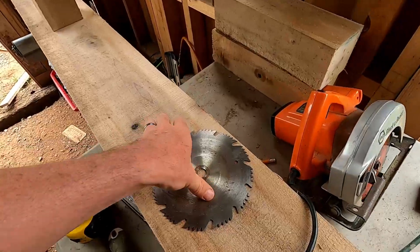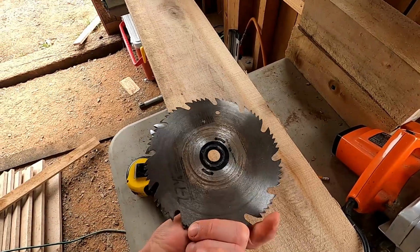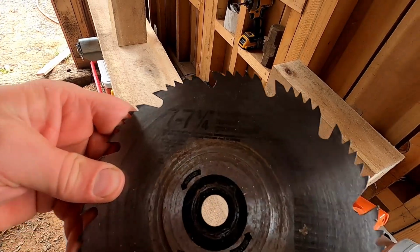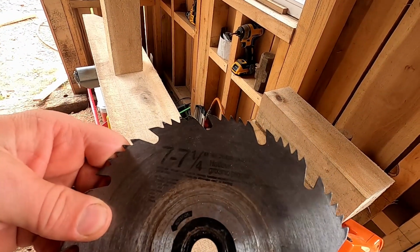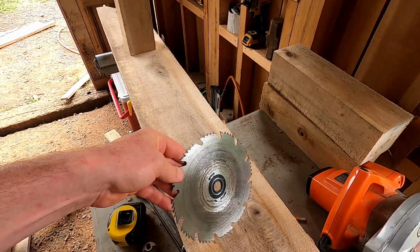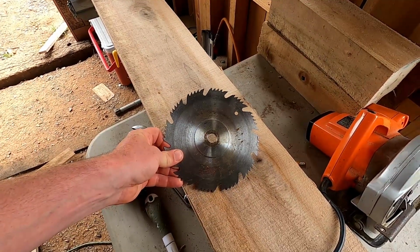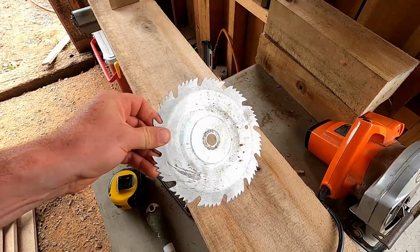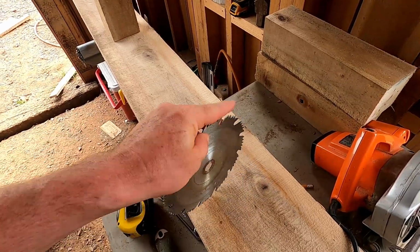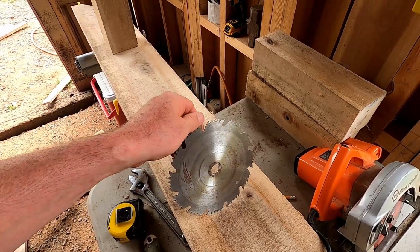Also, I wanted to mention, this is the blade, this old blade. I think it was a, what does this say? It's a 7 1/4 blade. Hollow ground, planer? I don't know. So that's an old, just plain steel blade. And that's what I cut those metal roof panels out of, and it worked fantastic. It's really dull now, but this thing will chew through that metal paneling easy. I wouldn't even bother getting carbide blades.